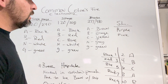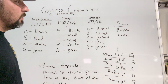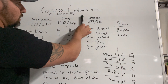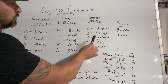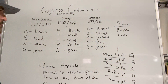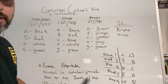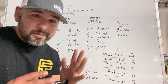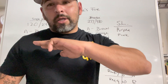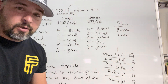The way I've seen it and most people respect it: 277 is brown, orange, yellow — or BOY, that's an easy way to remember it. And 120 is black, red, blue. Thank you guys for watching. My name is John Spear. Please like and subscribe, check us out on YouTube, TikTok, Instagram — we're on everything. Hope you guys have a great day.